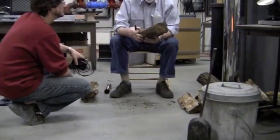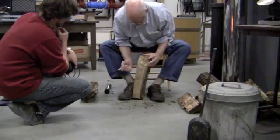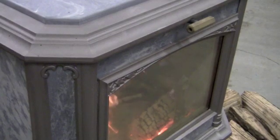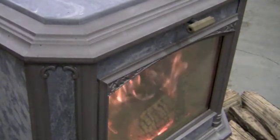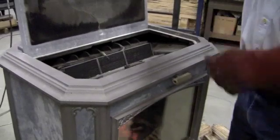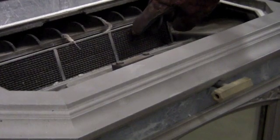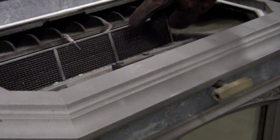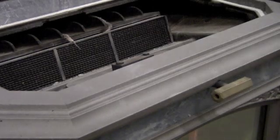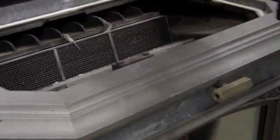This piece is 31, 34, 37, and 27 — so we can assume that maybe the 27 was facing the sun. This is a fire that's almost at the desired coal bed, it's down under three pounds. This stove has a catalytic converter which you can see right here — it is a stainless steel foil catalytic converter developed for the diesel truck industry. This is a thermocouple measuring downstream temperature and this is the bypass. I won't open the bypass because we've got a lot of smoke out, but you can see it's basically doing what it's supposed to do.